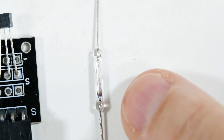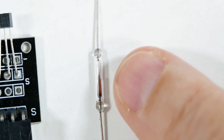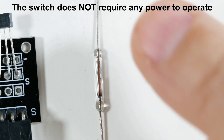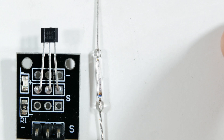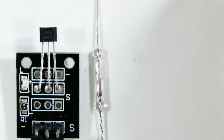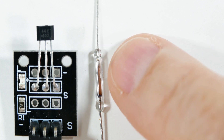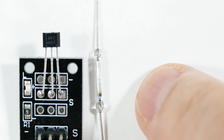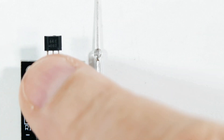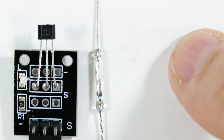Some of the benefits, though, is the fact that this thing requires basically zero voltage to operate — it'll transmit zero voltage. It doesn't take anything to activate it, just a magnetic field. The Hall Effect switch over here takes three to five volts to operate, so that's one big disadvantage. This reed switch is hermetically sealed and won't be affected much by nasty environments, whereas the Hall Effect switch — temperature, water — these plastic envelopes will get soaked with water and become unusable. The fact that it has voltage and a plastic envelope makes it a little more susceptible to negative environments.